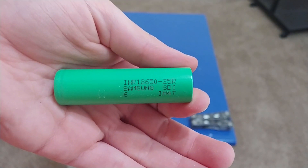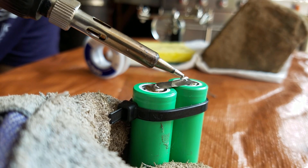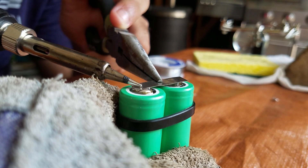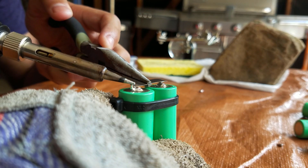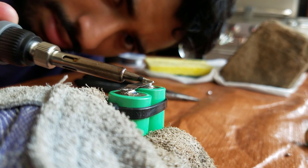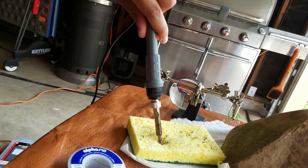For the battery pack, we went with Samsung 18650 cells. Soldering them in a 14S2P configuration would give us the 48 volts required for the motor and 30 amps of continuous current. We would have preferred using a spot welder to nickel up the battery, which would have been easier, quicker, better looking, provided a better connection, and conducted less heat to the batteries — but the eBay soldering iron was way more budget friendly.